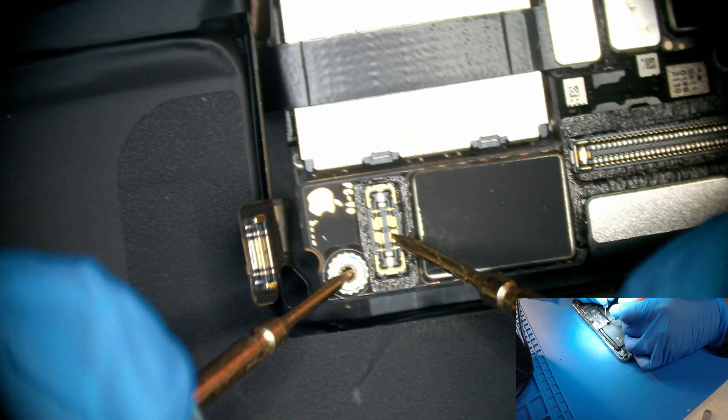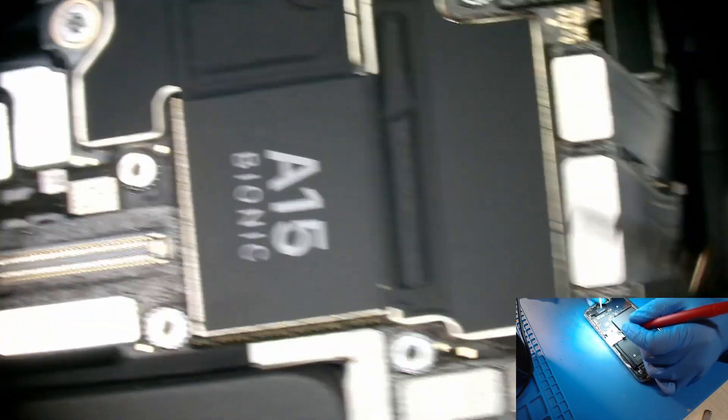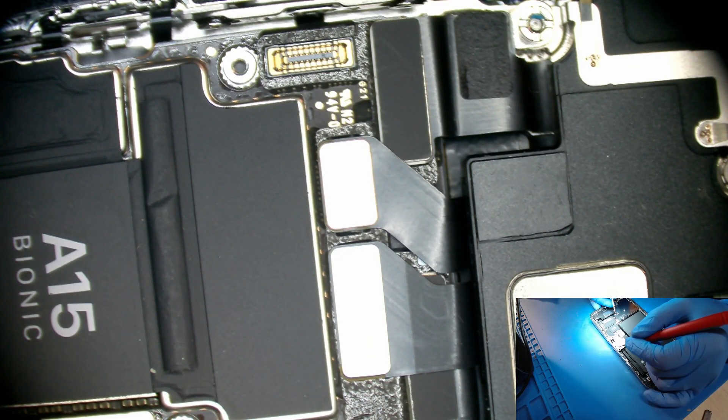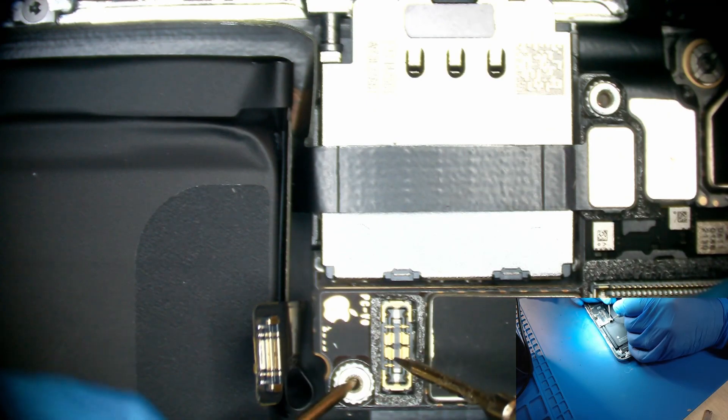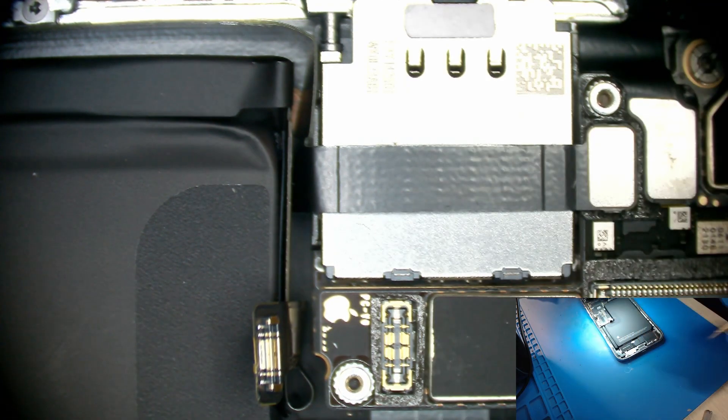The diode mode reading is 0.26 volts — it should be around 0.31 or 0.32. Usually if you're seeing 0.26 or 0.27, it's likely there's a partial short somewhere. The other pins are reading 0.6, 0.7, 0.8, so those are okay. Now let's test the battery voltage.